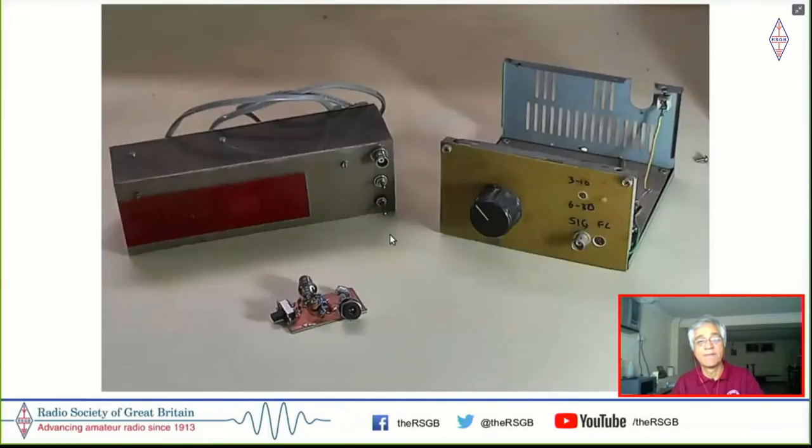And this is my simple home lab to begin with. So what you see here in the bottom is my crystal oscillator. I had a frequency counter, and this is a signal generator which I had built. I have scavenged some parts out of it, but it still works. The on-off switch and the band switch is gone. It's just doing one band right now, but it essentially has a broadcast radio capacitor inside it, so it's a large bandwidth VFO. It goes from 6 to 30 megahertz and gives one output. There's a parallel output which went to the frequency counter, but the frequency counter used to be noisy, so you had to switch it off when doing measurements.